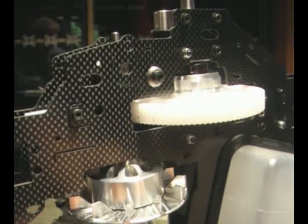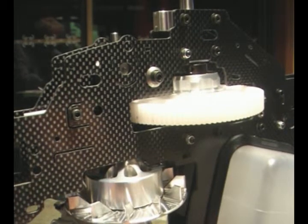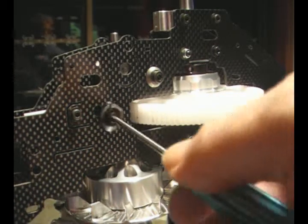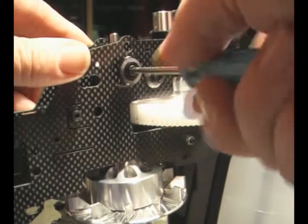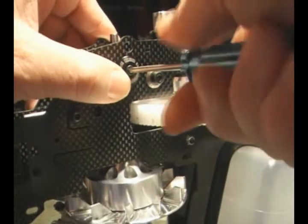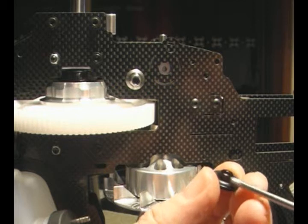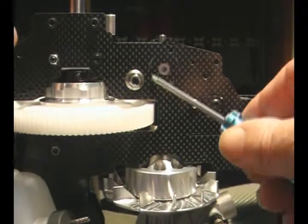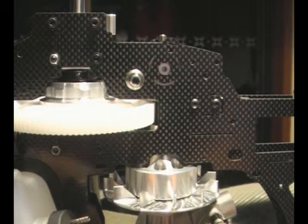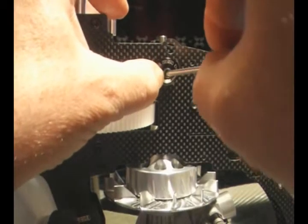Then we offer up the mounting dampers. As explained before, we're going to keep these right to left, so we'll actually put a mark on one side so that we preserve the orientation in the future, but just for now we'll gently place them and start to screw up so that the moulded interior on the mounting dampers goes into the recess on the carbon frames just before the M3 bolt goes into the mounting block.